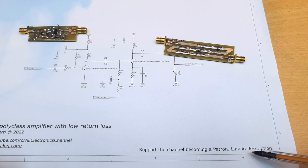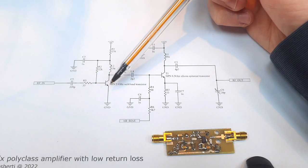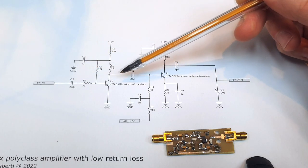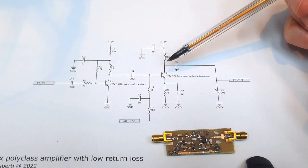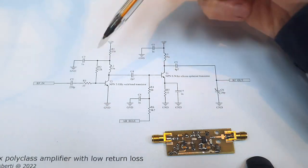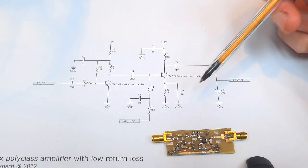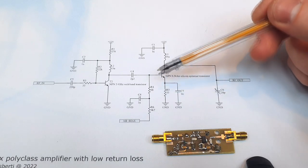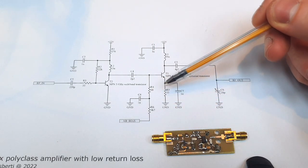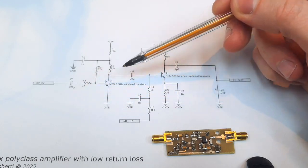The main idea is that we have a first amplification stage excited by the signal from the delay line. The output of this stage excites a second power stage that generates sufficient power for transmission. We use two stages of amplification because the first stage is responsible for input gain but also generates a well-defined impedance at its input, while the second stage generates power with controllable gain.